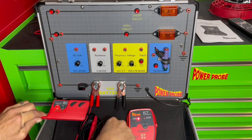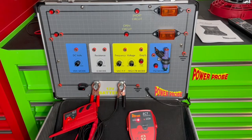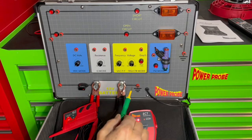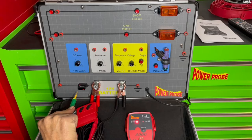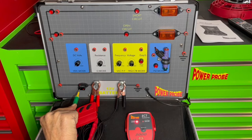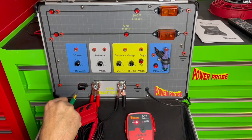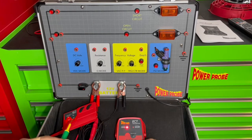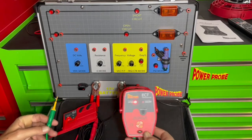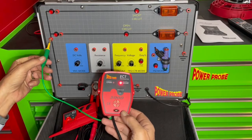It's a pretty simple concept, but it does take a little technique to get the best results. This signal wire is putting out a signal and most people, by habit, tend to plug it in where the fuse goes. That may or may not be the best place to work from. The fuse is blowing so there's at least a short from that point somewhere along the circuit. But the transmitter doesn't care where you inject the signal — you can inject the signal here or farther up the circuit.